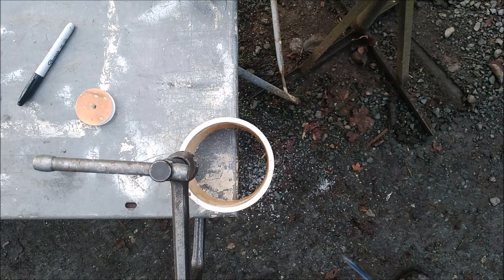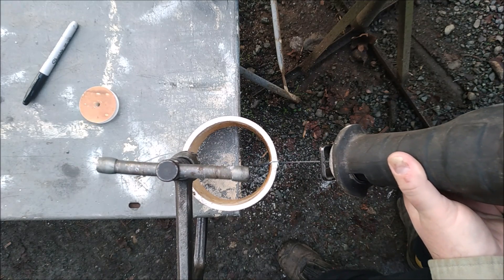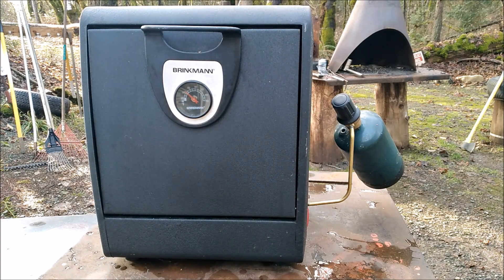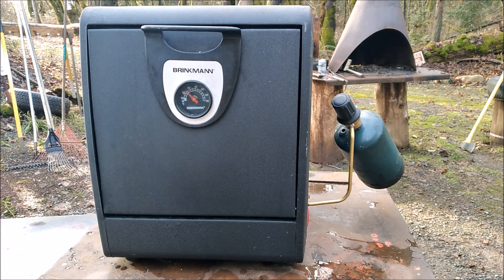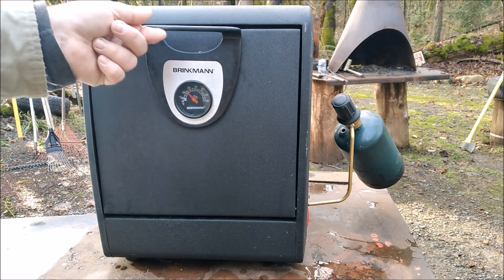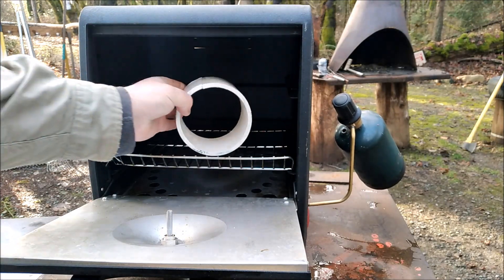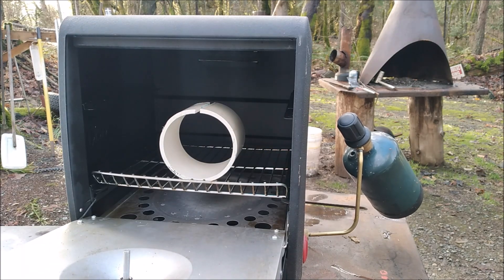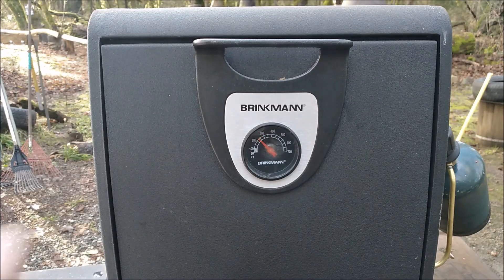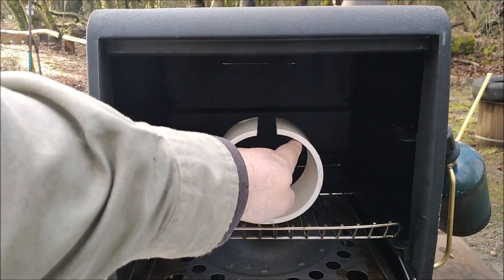I probably should have made a slit in this — I had it on the whole pipe — but here we go. This is my little portable oven that I got from a garage sale. You can see right now it's about 200, a bit over. We're going to see what it takes to melt this. I burned it last time going at 350 — that's too high. So I'm going to try to keep it at 250, maybe 275. I'm just going to put my piece of PVC in. Something to mention is that I put the seam where I cut it at the top so it separates correctly. It's been five minutes at about 250, and you can see it's starting to get flexible.